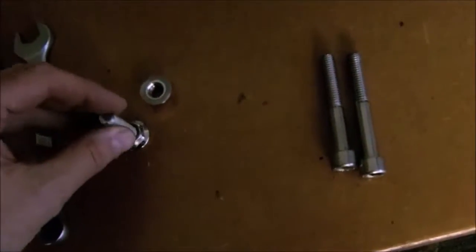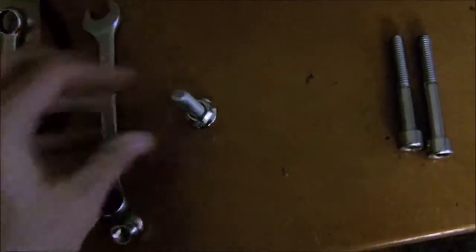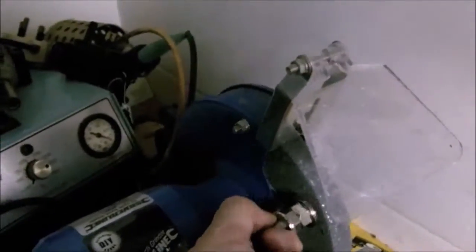Put the nut on a bit of studding, put the other nut on the other side, then lock them up with a spanner. Then grind, grind, grind — gives a flat face. See the contamination on that side? Nice and flat on that side.